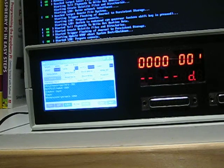If you have it set to the wrong processor for the board, you'll probably get no results, or you'll probably get the thing locking up. So just be careful whatever processor you set it to. It currently only works for 8-bit processors, so Z80s, 6502s, etc. There's 3 supported. There's an 8080, which is the Space Invader ones, of course, Z80s, which are pretty common everywhere, and a 6502. These two definitely work. The 6502 should work, though I haven't got any 6502 boards, so I can't really prove it, but by rights it should be okay. So anyway, it's set to a Z80.